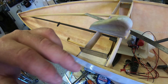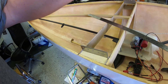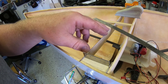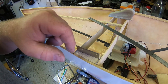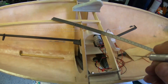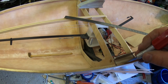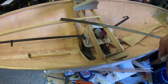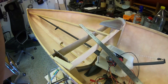This will give additional adhesion when I put epoxy on to glue the deck on, and this will be covered too. It will create a beam in the center of the boat. This is actually the second try — you only sort of saw me do it once. I tried twice; you need a pretty good fit. Put a little bit of epoxy on there and we're going to be good to go.